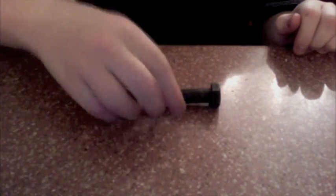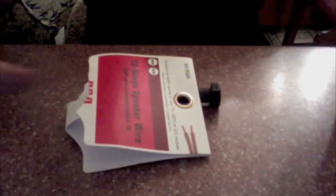Your procedures are fairly simple. Just take your iron rod and lay it out like that. Next, you'll take your copper wire and you're going to split them down the ends, because they come in twos and you only want them by themselves. So you take your razor blade and you split down the middle about an inch, then take each by the ends and you just pull all 50 feet apart. Pretty simple.